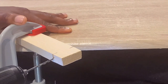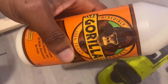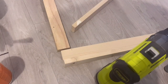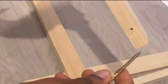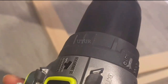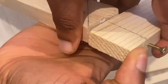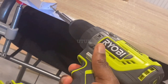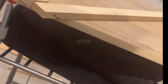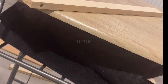When pilot drilling, screw down the screw on standalone pine woods before attempting to assemble both pine woods together, as this makes it a lot easier to tuck-tighten. You can also infuse some gorilla glue in between both pine woods to provide a steadier built frame, essentially providing the solid rigid connection needed for the housing pillar structure.